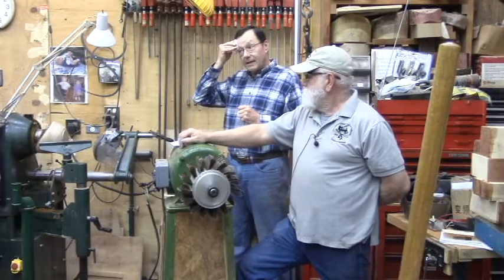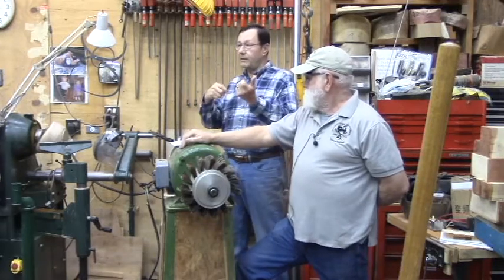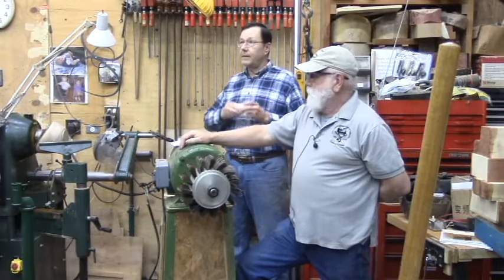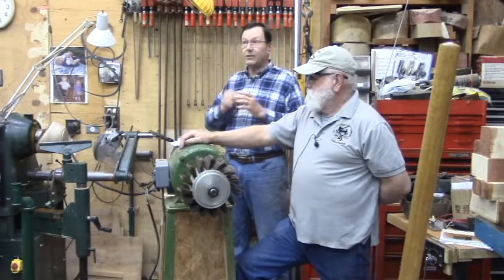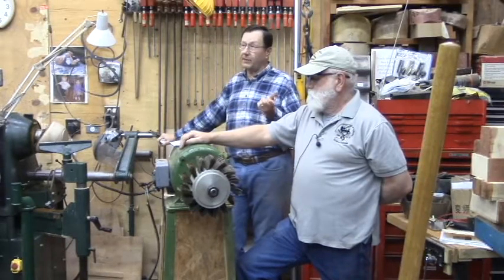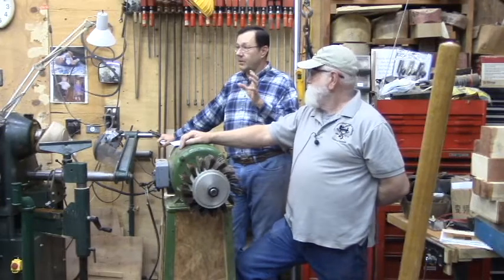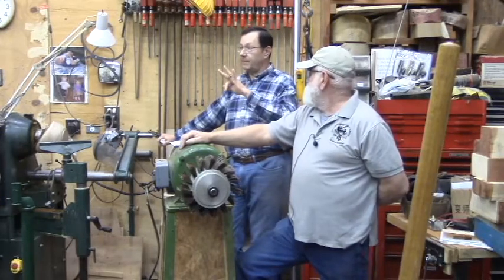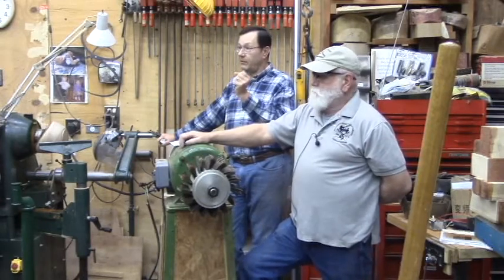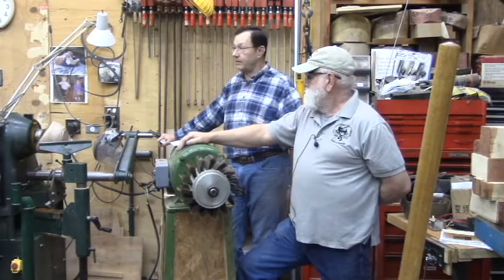It also means that when you get into the three-phase equipment, since you have three wires going in, the wires don't have to be as big for the amperage that you're having. So if you have a 2-horsepower, 3-horsepower, 10-inch table saw that's running on 110, you're looking at somewhere like 18 amps. If you have that same saw in three-phase, you really split that by three, so you're 6 amps per wire, so your wire size can go down to that 6-amp thing instead of the total 18-amp, which would require some much heavier cabling.